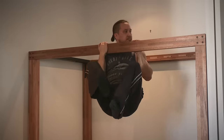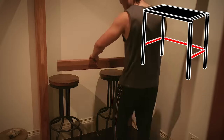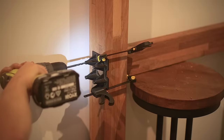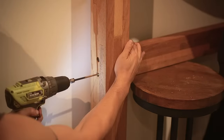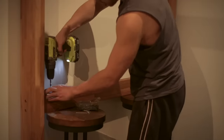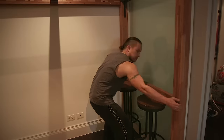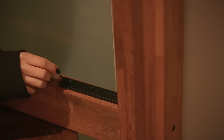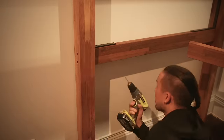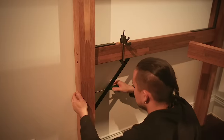Quick strength test - all feeling good, but certainly not stable yet. Time to add the mid beams using the same jig and spade bit. I needed extra long coach screws for this join to get through the post, and once again secured them with L-brackets to prevent shearing. It was at this point that I learned my floor was in fact slightly sloped, so I had to compromise a little bit on the angle of the side beams - which of course had to be black. I still wasn't very happy with the amount of forward and back rocking, so I really needed to add some triangle shapes to make the whole structure more rigid.